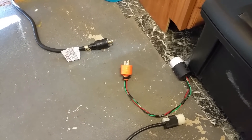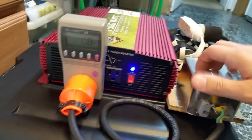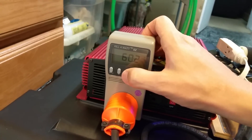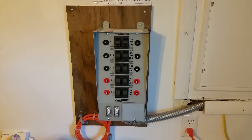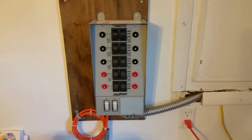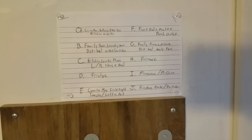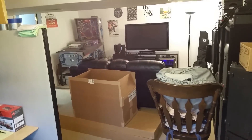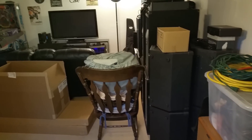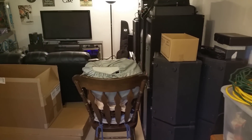So we're going to connect this up and then go to the transfer switch to show how it works. Everything is connected up and I'm only drawing about 1.5 watts, likely from the EMI filter. We have 60.2 hertz and 116 volts out. Over here is my transfer switch — it's a Reliance Control 2-pole, a pretty standard model I see in a lot of houses. Here's my breakdown of which circuits I'm backing up, and I also have the watt meters. I turned on some lights to show what happens when I switch over from utility power to the inverter.